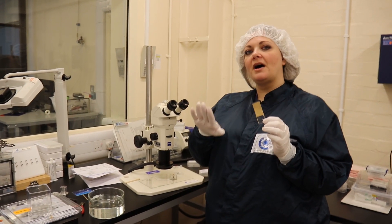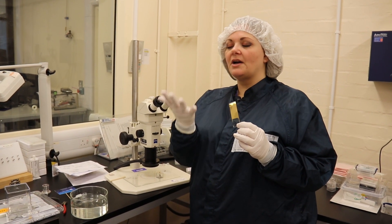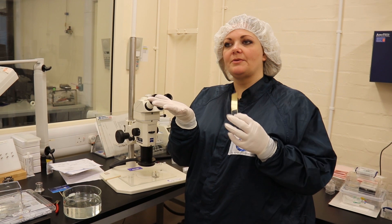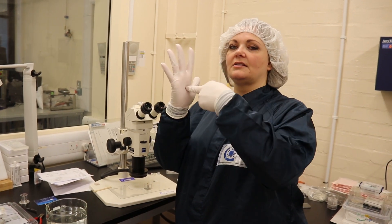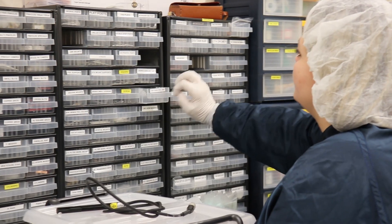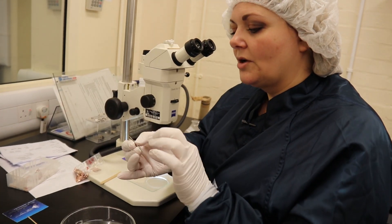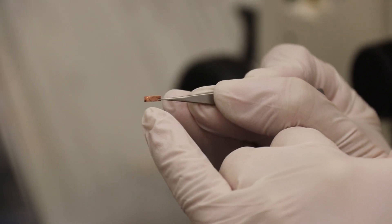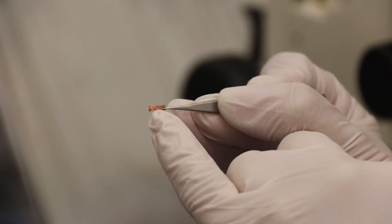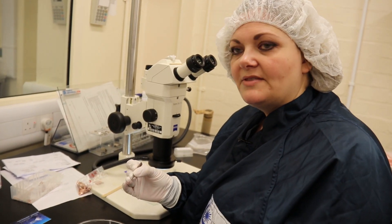The foil is the main part of the target. Once the foil is floating, we then need some kind of support or mount to float it onto, that's going to support that foil ready for the laser to fire at. This is what we call a copper finger mount, and on the end of this finger mount there is a 200 micron hole, and over that hole we want to put one of these foils.